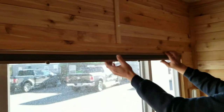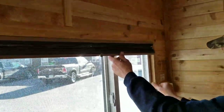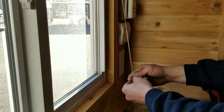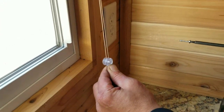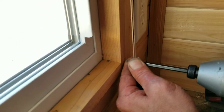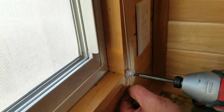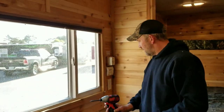So now, what do we do with the actual adjusters? This here is your adjuster, your tensioner — it keeps the blind up. We take this here, place a screw in the center of it, pull it down to the bottom of the window typically, pull your string so that your blind is tight, and then just screw it in. You try to keep the strings even so that there's an even tension on the whole blind itself. Let's do the other side.